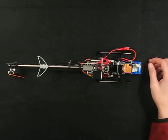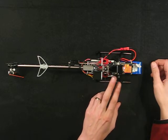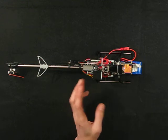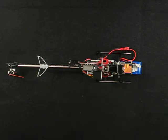Step B is for the Swashplate Servo Frequency. The Hitec HS-5065MGs do use 200 Hertz. The BeastX servo database says 200 Hertz for these. So we'll just use the rudder stick. Purple is the default at 50, so we'll use the rudder stick and cycle through each of the colors until we get what we want. 200 is solid blue. You can go in either direction, it doesn't really matter. When you get the setting that you want, then you can move on.